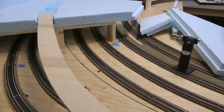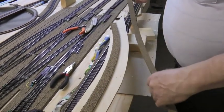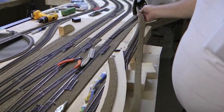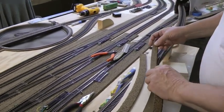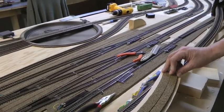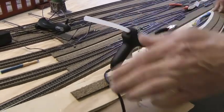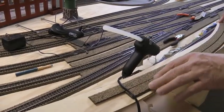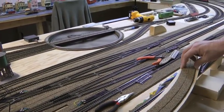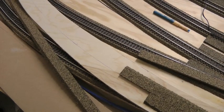We're back — it's about a minute later. Cork with glue sticks right down, takes a couple of seconds to dry, and that's it. The next important thing — putting the other piece on. You want to put the flat side to the flat side, but you want to stagger them. When you put your second piece on, stagger it up a couple of inches so your end joins are never the same. It looks a whole lot better, and it just works better when carrying on across. You're cutting off two inches but I'm sure we'll find a place to use it — I never throw anything away.